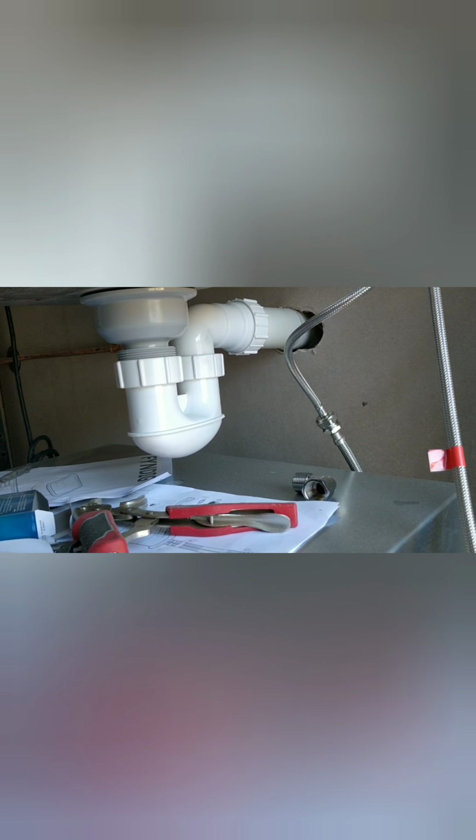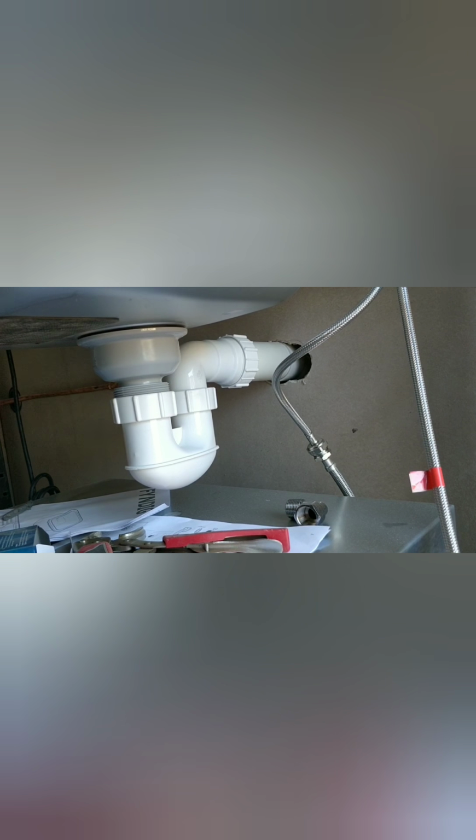So back through here, so the sink. I changed my mind where I was going to put the outlet for that sink there, because originally we weren't actually going to put an S-bend in here. I didn't think I'd have enough room with the dishwasher, but it turned out, fortunately, that we did. So there's another S-trap underneath the floor, which we'll see in a moment, but it was good I could still fit one in, because I think the spec is between the main line and an S-bend, it's not allowed to be more than 600 or something like that, and it was longer than that. It wouldn't matter practically, but since I've got the room, I'll just double up. So there's our hot and cold water again, and there's our pipe coming up here.